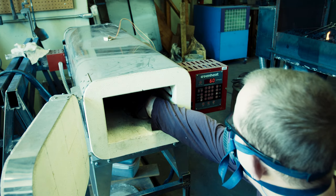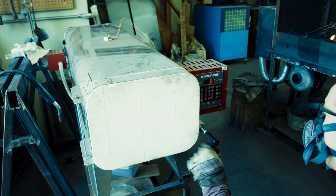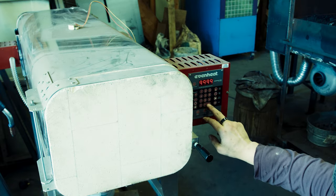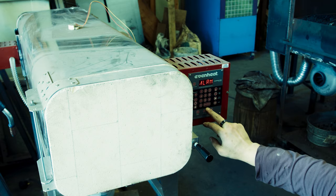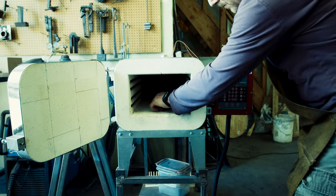As a final step, I will place the flatter in my heat treating oven to control the reduction in hardness by temperature. In this case, I am heating it quite high to 600°F for about an hour. On video, this hour is over quite quickly, so let's take a look.